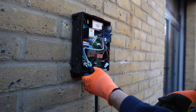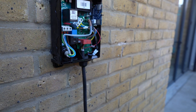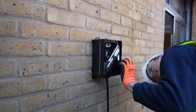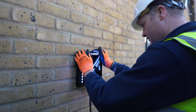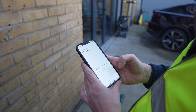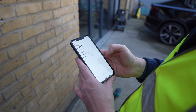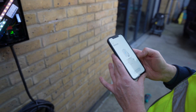The unused bottom cable cutout is plugged and the LED frame installed. These Hypervolts feature multi-color LEDs all around the perimeter and in the middle underneath the bolt logo. The test mode shows how that looks, but they can be customized to your preference. Moving to the software side — all handled by the installer with Hypervolt's in-house setup app — it's super quick to establish the Wi-Fi connection, create an account, and once ready the lights flash to indicate everything is good to go.